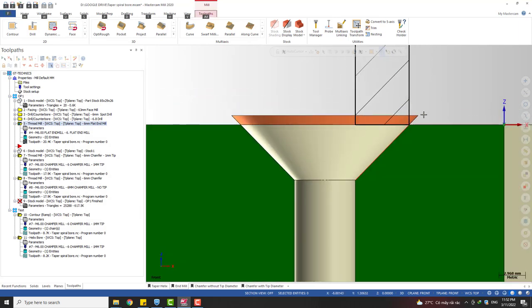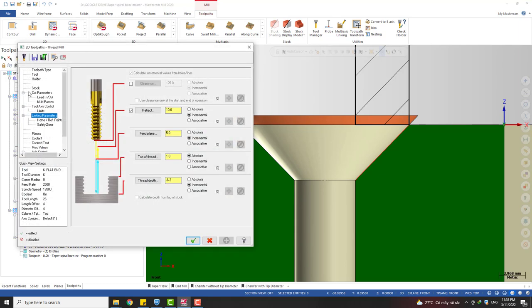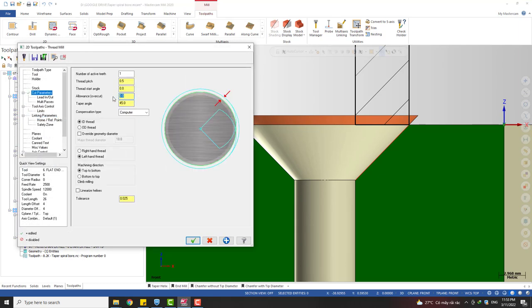So you need to compensate for that. You want the tool to start from a higher position, but still keep a little material. So you need to use this one, that's allow an overcut. That's some kind of will extend the toolpath. So this one is calculated by diameter, not radius. So keep in mind that this is the offset diameter. Yeah. So I'm gonna try to extend 1 millimeter, two millimeter, because it's the diameter. I move the tool up 1 millimeter, so I need to expand the diameter by 2 millimeter, because this angle is 45 degrees. You can do some calculating, okay, and you understand this value.